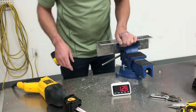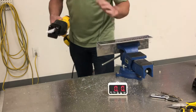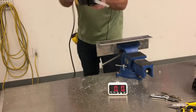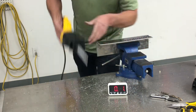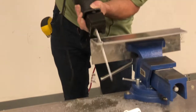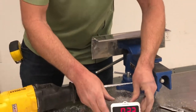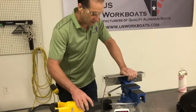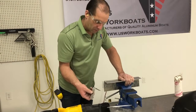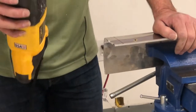I'll reset and this time I'm going to cut towards me — that's the way I want to do it. And ready — go. Now you can see that the reciprocating saw, that sawzall, is definitely faster. It does not make a real nice cut; it's not a highly desirable finish and it's hard to keep it going straight. This thing is an animal, but it's not a speed demon.